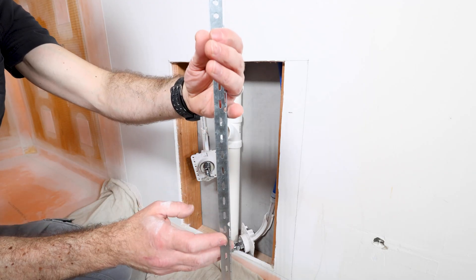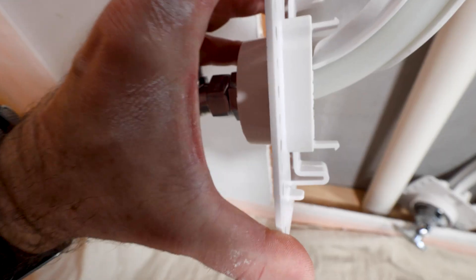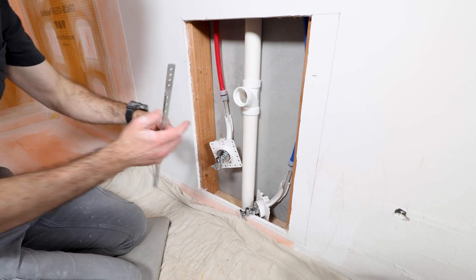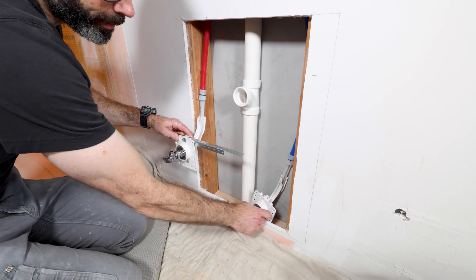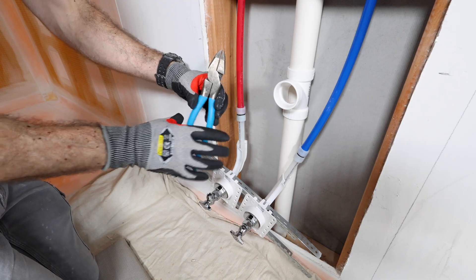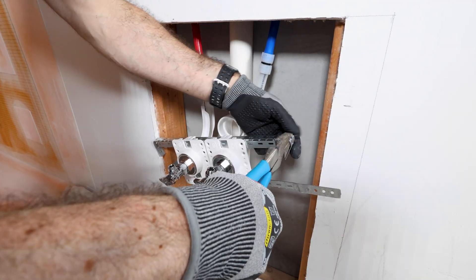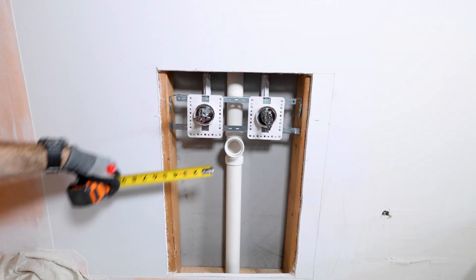This is a Holdright 170 bracket. It's got an L-shape to it, and I recommend this because there are slots on the top and bottom of the fixture outlet box where the 170 bracket slides through. I used two of these — one for the top and one for the bottom. I tried to do this at the same time for the hot and cold water supply lines. These brackets are solid, and I can bend them using lineman's pliers — I do recommend wearing gloves for this. I bend them to the dimension of the studs, so if the stud spacing is like 14 and a half inches, I just bend the bracket to fit within that space, then fasten it to the studs.